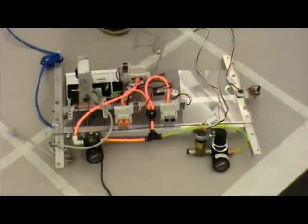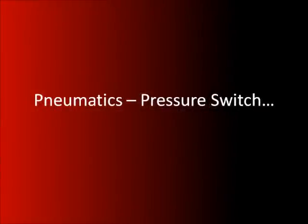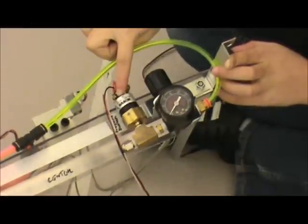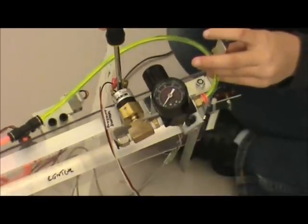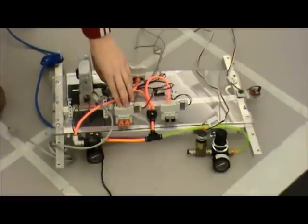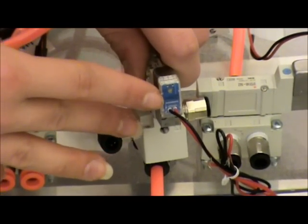The second tier of our electronics board contains the camera, the solenoids, other pneumatics components, and the gyro. Note that the pneumatics subsystem has a pressure switch which is connected to the C-Rio, telling it when to turn off the compressor. During the electrical inspection, the inspector will intentionally short out the pressure switch to test the pressure release valve on the compressor. This year we used 24-volt solenoids which are directly connected to the solenoid breakout on the C-Rio. In previous years, they used a 12-volt solenoid which had to be connected to a speed controller. The solenoid voltage is clearly labeled on the power input connector.